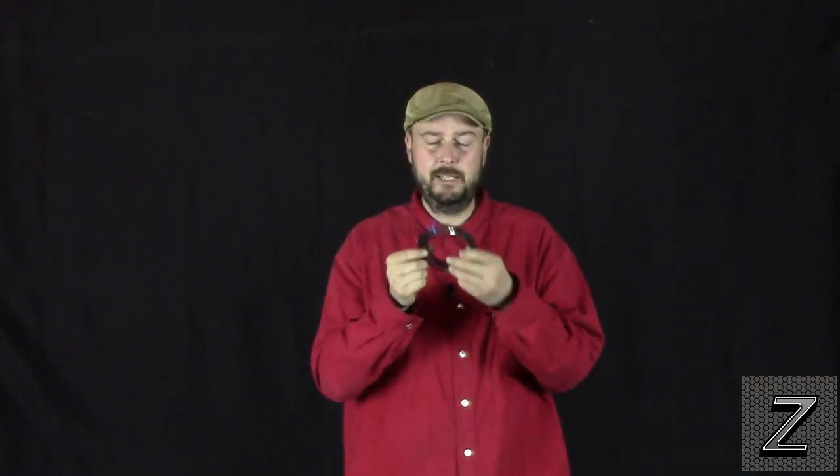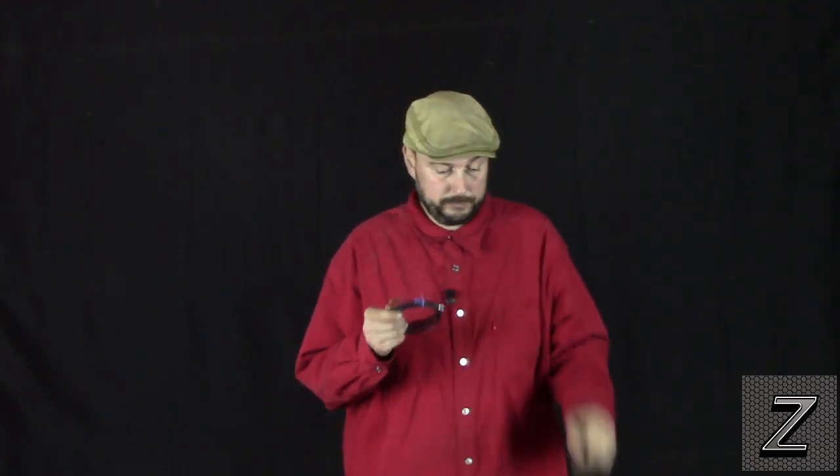That pretty much covers antennas. One more thing though: if you're in an apartment building a few floors up, you can put an antenna on your balcony and you won't need to run 40 feet of coax. You can use the smaller, thin cable because you'll only be running maybe 15 feet — I wouldn't go much more than 15, maybe 20 with this cheap coax. This here is actually RSMA, whereas your SDR radios use standard SMA — but again, I got an adapter. RSMA cable is more for Wi-Fi, but we'll get into that in a future episode with some Wi-Fi antenna beams.